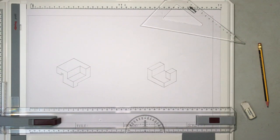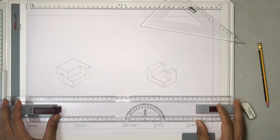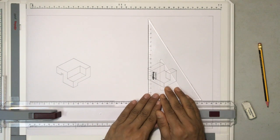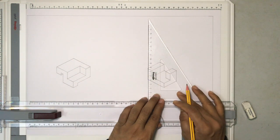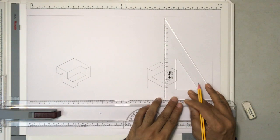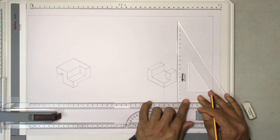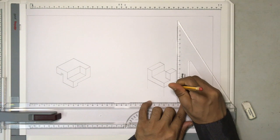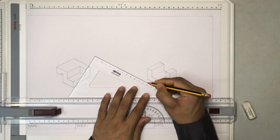Having completed the drawings, we will have to draw the dimension lines as well. In this part of the video I'm going to show you how to mark the dimensions in a given drawing. I'll show for this drawing — you can repeat the same thing. First, draw the extension line — I'm keeping my extension lines almost 3 millimeters. From here to here is the extension line; similarly here I'll draw the extension line. For this edge I can draw that, and when drawing the dimension line I'll draw it somewhere here like this.